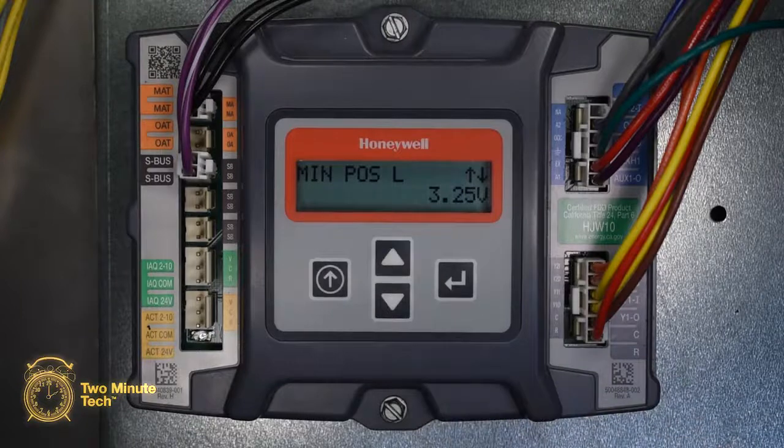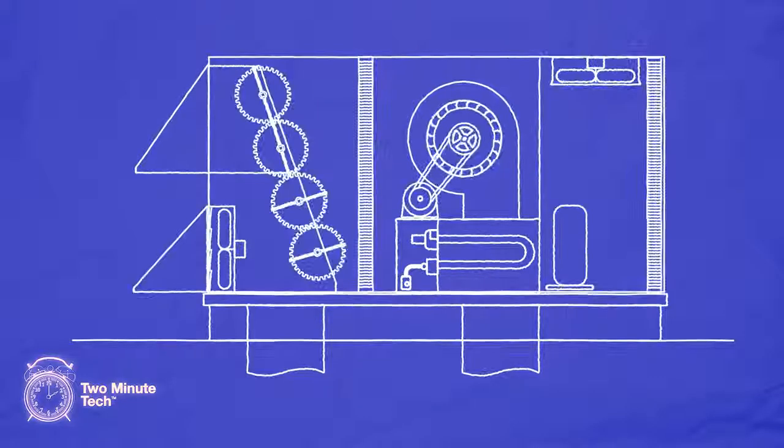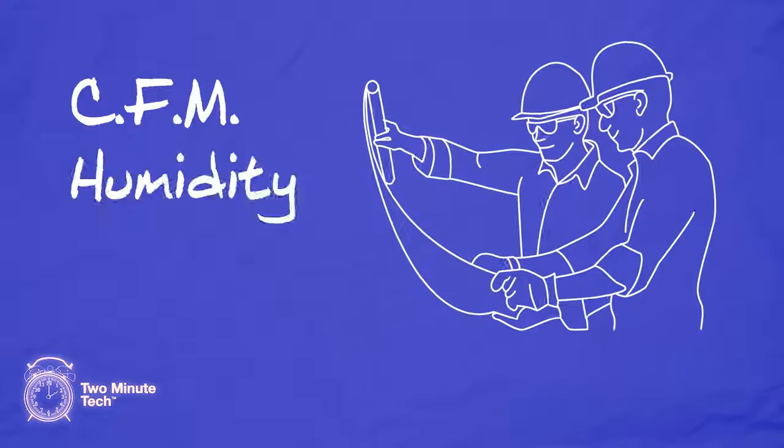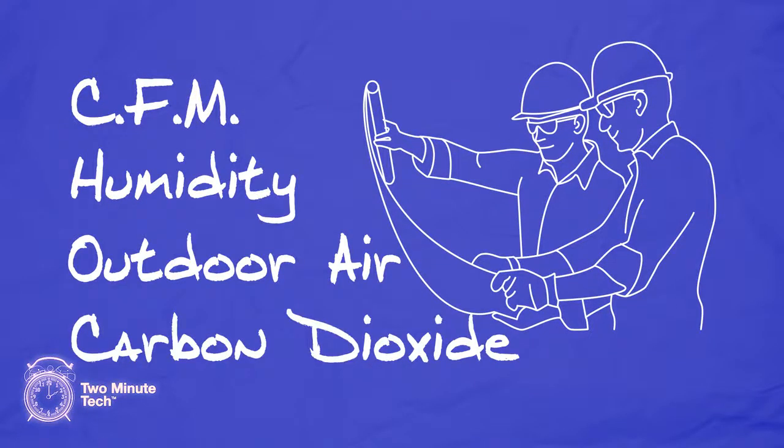Use the up and down arrow keys to adjust these settings and press Enter to store the changes. Again, the CFM must be measured for an accurate setup. As always, consult with a local mechanical or test and balance engineer for the specific requirements needed for your installation.